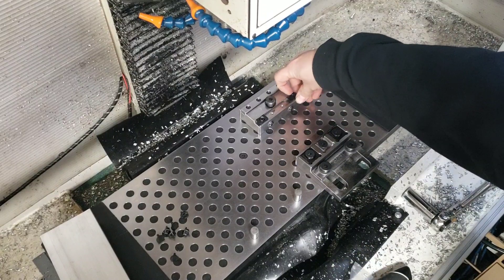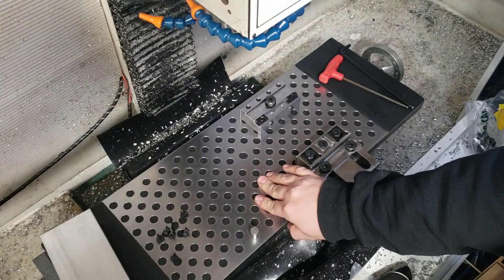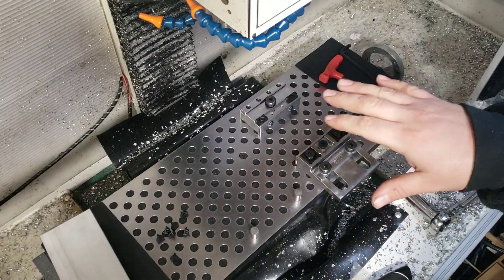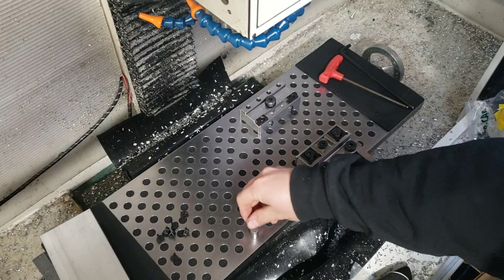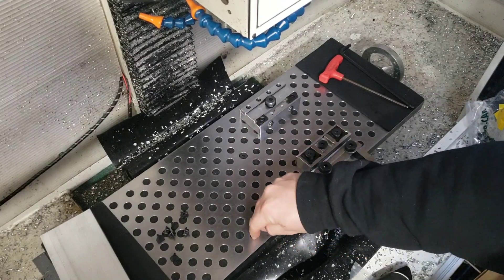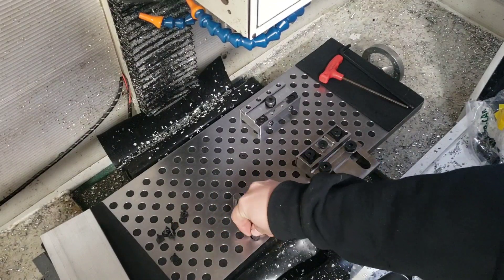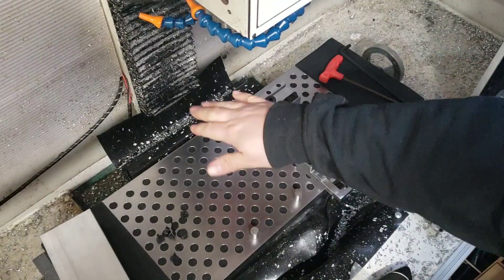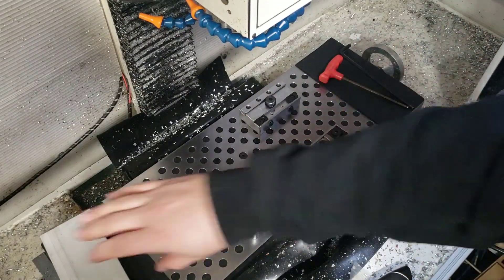I'm just doing a quick rundown here to show you this plate and some of the features. It bolts down — five bolts that are recessed hold it down to the original table. All the holes are bored for a half-inch dowel pin and it is a perfect fit. I've tried it in multiple places and the machining tolerances are spot on. Below that it is threaded for a half-inch bolt. Saunders Machine Works offers these rubber plugs which fit the holes perfectly. You just use a little pick to pop them out when you need them. The plugs are great for keeping out chips and coolant, so it will reduce the amount of times you'll need to pull this thing to clean it, though you'll still need to do it every so often.